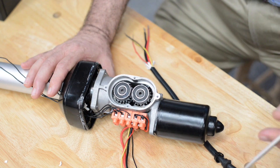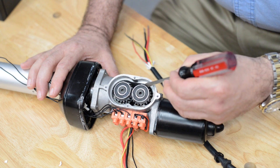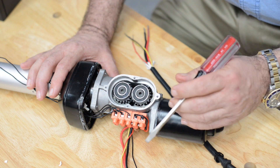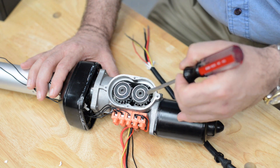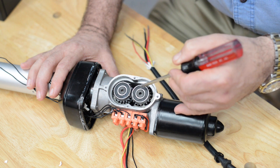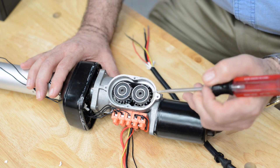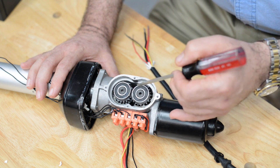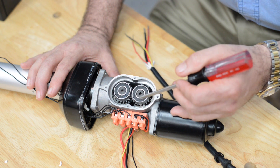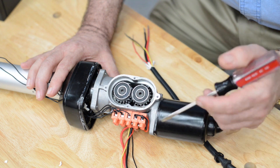Let's get a closer look at these gears. These gears are all steel and they're riding on sealed ball bearings. Below it is a worm drive that transfers the motor power to this gear, and when it goes to this gear, this is what spins the Acme screw. This is a very reliable gearbox — it has a five year warranty, and I doubt you'll have to use that at all because it looks like it's going to go far past that.